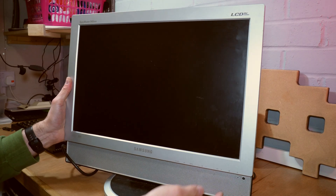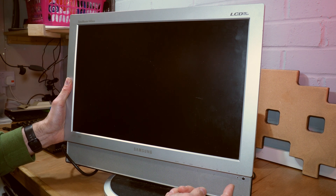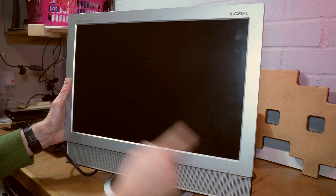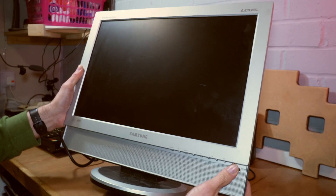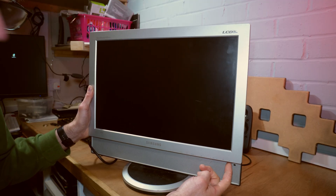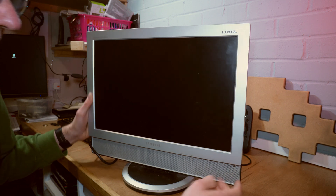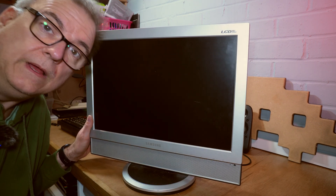Let me show you. If you look down here where the power light is, if I press the power button, nothing happens — the screen kind of flickers for a second, but nothing happens, and then eventually it will actually switch on. It might have actually gone a bit worse than it was before, so this is fairly typically bad capacitors. Let's fix that.